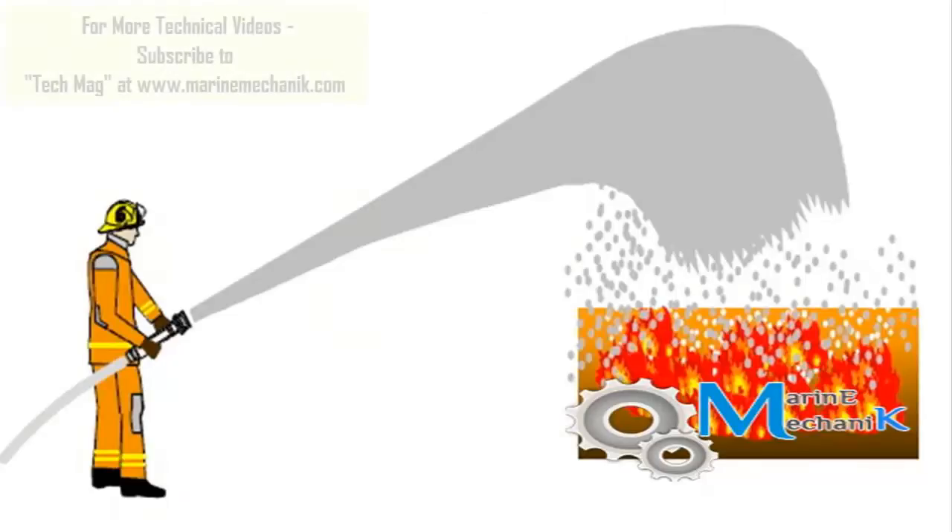If you don't have any bulkhead or space to sweep across the base of the fire, you use the rain down technique. That means you lift up the nozzle and allow the foam to climb to a certain height and then fall as little sprays upon the base of the fire.